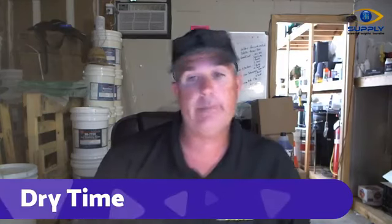Now, let's talk about dry time. The surface will be dry in about 60 minutes. Now that's based on temperatures between 65 and 85 degrees with a 50% relative humidity. Now in Florida, we've never seen 50% relative humidity except for maybe 2 days out of the year. Now out in Arizona, they've got no humidity. It can dry a whole lot quicker. So based on low surface air temperature or high relative humidity, if you're getting down into that 40 degrees or you're getting up into some super high humidity, then realize that that's going to extend the dry time.